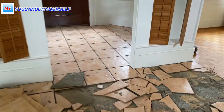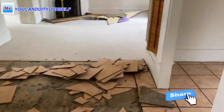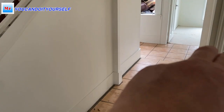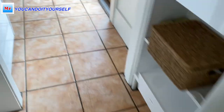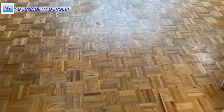This is a very interesting project. We have tiles, floor, kitchen, and another floor with carpet. The tiles here are too high and the whole house is sloping to one side too much. I'm going to remove the tile by the entrance and leave the tile in the kitchen, because if I patch the front a little bit it's going to be level with the hardwood.